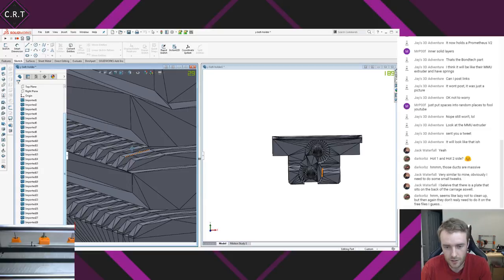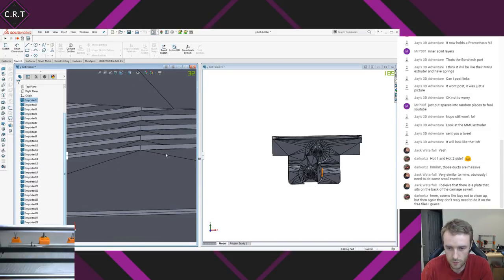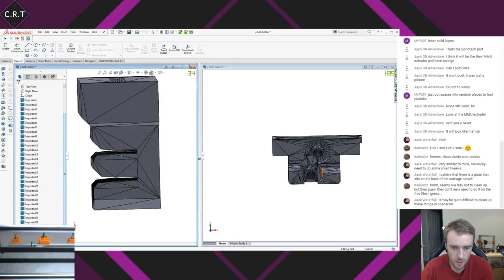Presumably it's a result of, again, the weird SCAD thing. It looks like the top of that surface lines up with this one. Yeah. So what they will have done is have, presumably it would have gone straight and straight, and then they used that slight bevel there and that one, and that was one cut, and then they made another change where they added this second cut, and whoever added this second cut didn't mate it. Well, you don't do the same sort of thing in SCAD, but they obviously didn't make sure that that geometry covers the full area of the triangle they were cutting out, which left this little mess, which is unfortunate.